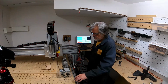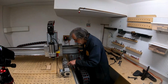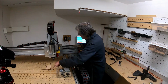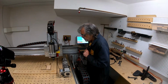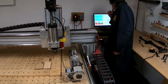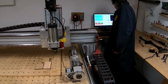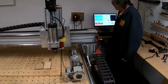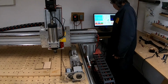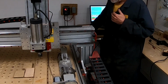The machine has what's called work offsets. The work offset for the fourth axis, the zero is at this point. The work offset for this is over here. I need to go to the toolpath program and set the correct work offset. Okay, I'm checking the G-code to make sure that I have a G55, which is work offset 2, and going to try it again. So release the e-stop, reset the machine, and see if it works any better this time.